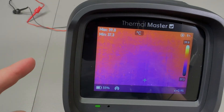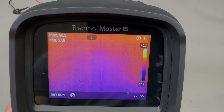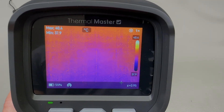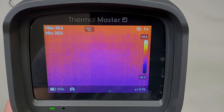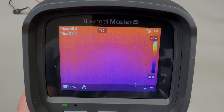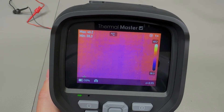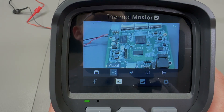Another thing I noticed is that sometimes the image does contain noise artifacts, and it's not just in super resolution mode — also in standard mode. Take for example images where I have the shutter closed on the camera: you can clearly see about a 3-degree Celsius gradient on the image. I'm not concerned about that because it's present on all cameras I previously tested; it just shows up more on this particular unit because of its bigger, higher resolution screen. The vertical lines that sometimes show up on screen as noise artifacts are more of a concern. This camera also seems to do the internal shutter calibration less often, so maybe some firmware tweaks would better compensate for that.